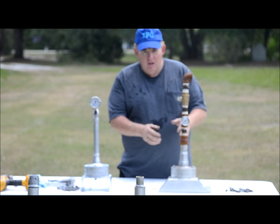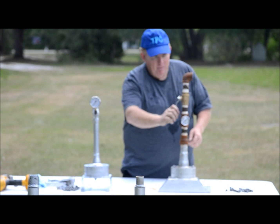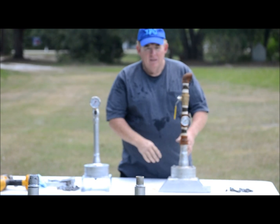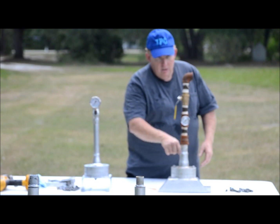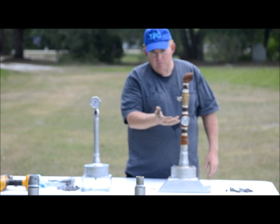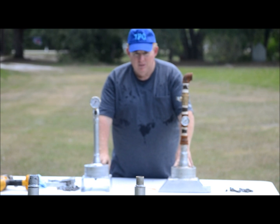We'll put the locks in, lock it on, and tighten the bolts down. The valve will be open while we test, so the water will run out this pipe and there's no head pressure building up as I'm trying to lock it on. Once the unit is locked on, then I'll close the valve to stop it. Then it builds pressure. Okay, very same housings, very same seals.